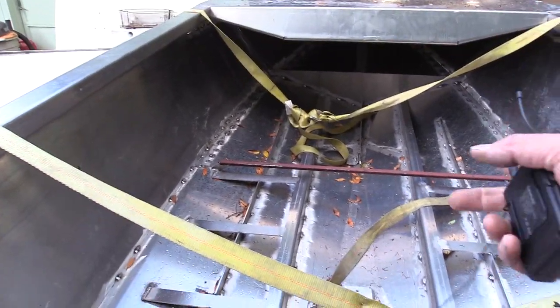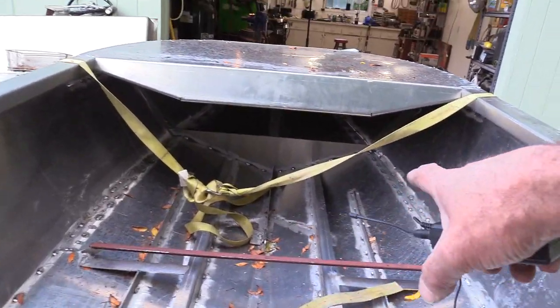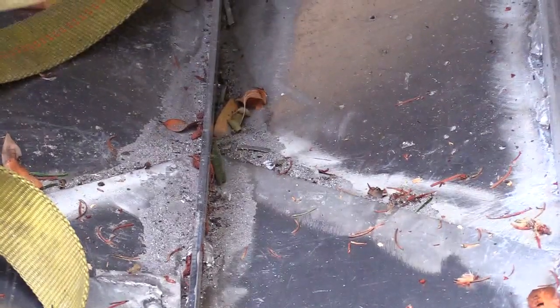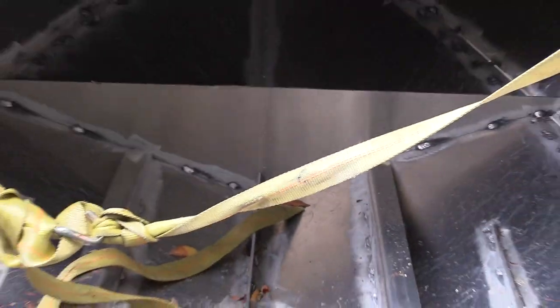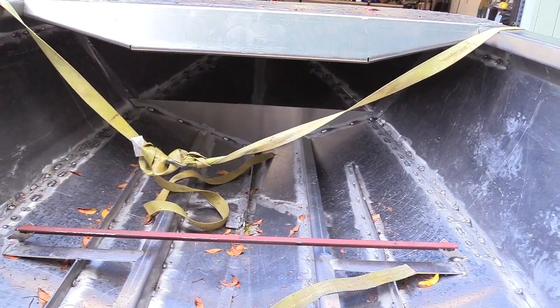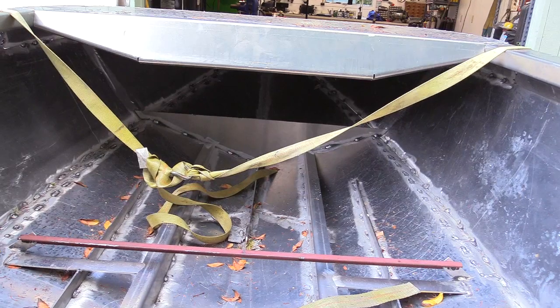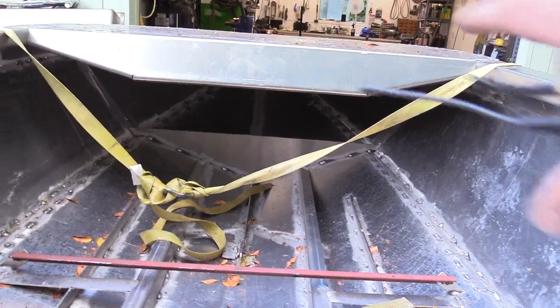You pull those two together, the front of these outer hull plates, where they meet the keel, the front of the boat is aligned with the keel, edge to edge on the bottom. Left side's lower, right side's higher. That's how you assemble the boat. How do you expect that to carry up? You know, it's going to carry up. As you pull those front together, you're solidifying your twist, even if they're matched.